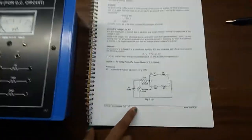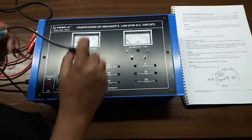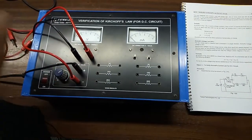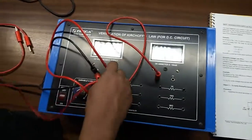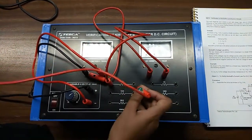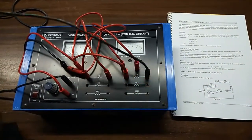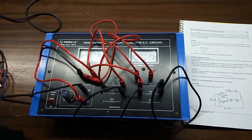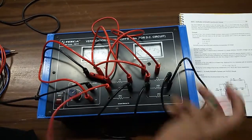This is the circuit diagram that we are going to build for this connection. First, connect the power supply with the DC voltmeter in parallel connection. From the voltmeter's positive terminal, connect the positive terminal of the DC ammeter. From the negative terminal of the ammeter, connect it with resistor 1k, and connect this resistor with the others, with this terminal of the resistor connected to the negative terminal of the ammeter.